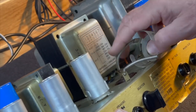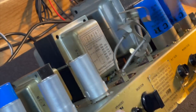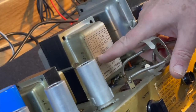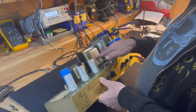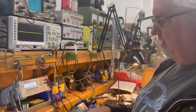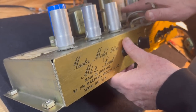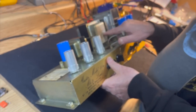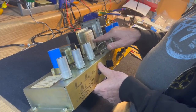So this is a sticker that goes on either a 50 or 100 watt amp that says 5 and 6 or 4 and 5. Or 4, 5, 6, and 7 are EL34s or 6550 USA. So they're saying that the amp is shipped with EL34s everywhere except in the US, where they go with 6550s. So this is right at the period where they started doing that. And Korg started doing that because of the number of warranty claims that they were getting for defective EL34s here.